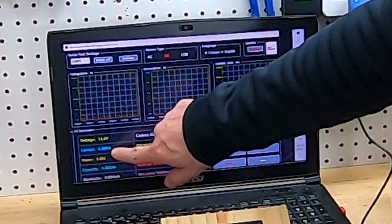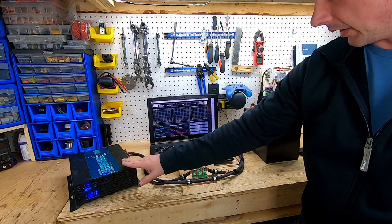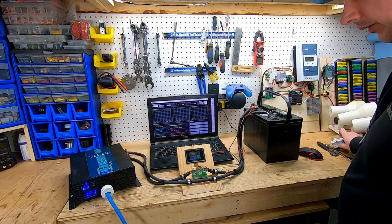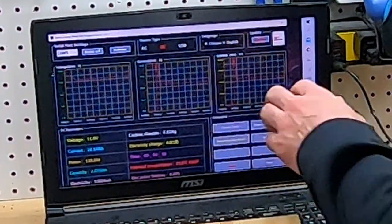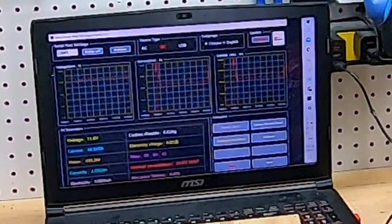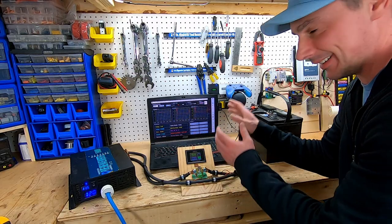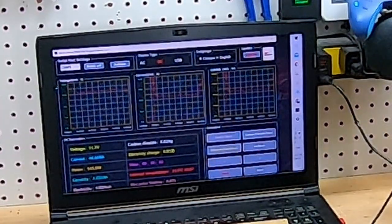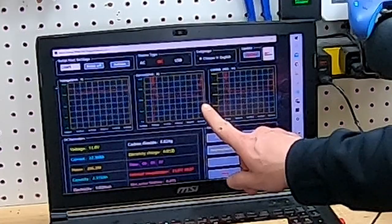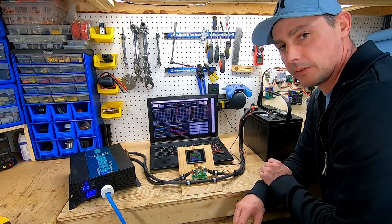And there you go — you can see we're drawing almost 500 milliamps at about six watts. So the standby consumption on this inverter is six watts, which is pretty good. Let's fire it on. You can see on the graphs here — now if I increase the power, you can see it coming up on the graphs. That's pretty cool for a $20 little unit. Increase it a little bit more — you can see it bumping up there. Now decrease — and you can see it dropping off. We'll end the test. In just that little span, I've used 2.35 amp hours.